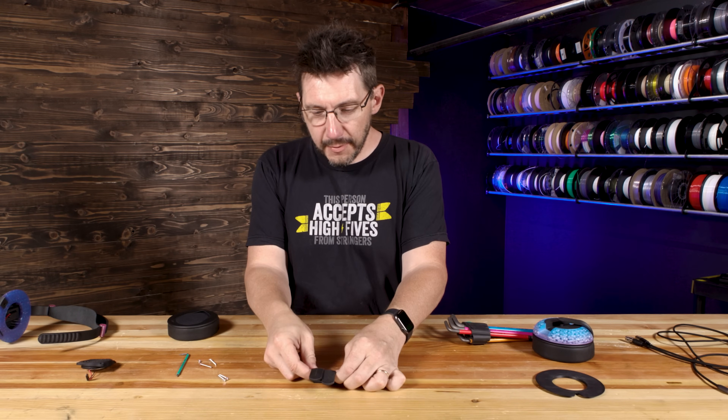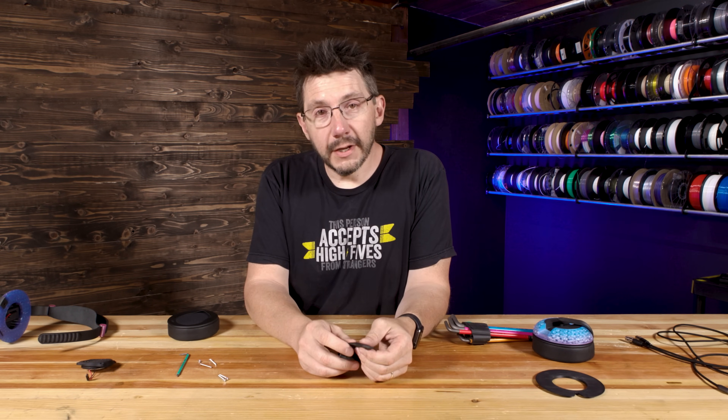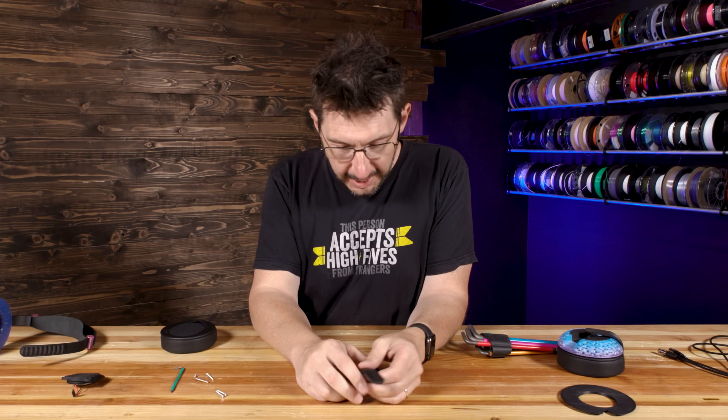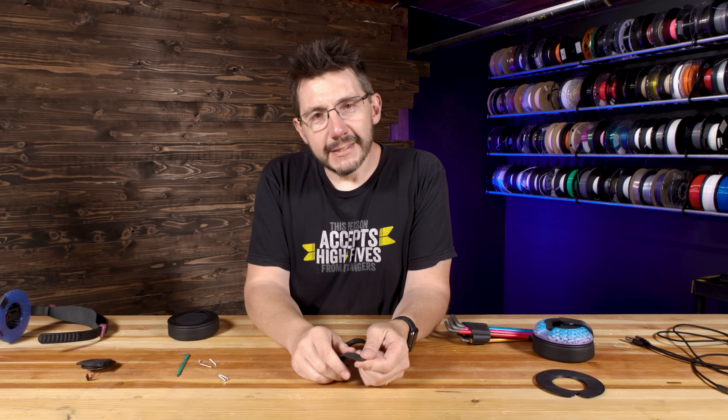Carbon fiber nylon is a fantastic material. At the time I made this it worked fine, but time makes fools of us all — time told this material to move a little bit, and that's why it didn't work out. Carbon fiber nylon and Onyx specifically from the Markforged Mark II: great material used in manufacturing everywhere, but fully supported it will last probably longer than you and me. For these headphones, it's going to be best if this piece is printed in a more constantly rigid material, such as PLA. So let's get these new ones in the headphones and put them on and see how they work out.